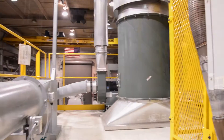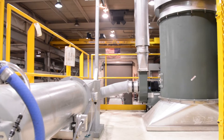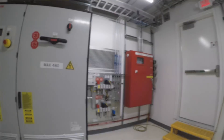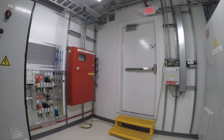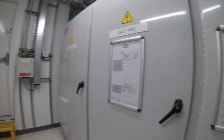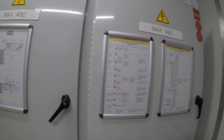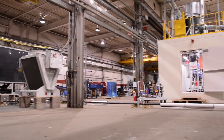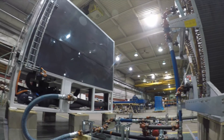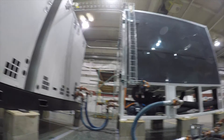One of the available features is a combustion air system that controls both the temperature and humidity of the air. The rear mechanical room, where the main electrical enclosure and drive panel reside, also has its own dedicated HVAC system. The particular cell we're in now has the deep thermal shock feature, which allows the customer to cold soak the engine to minus 35 degrees Fahrenheit.